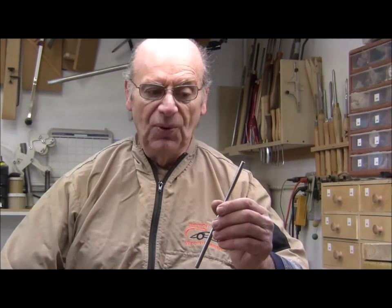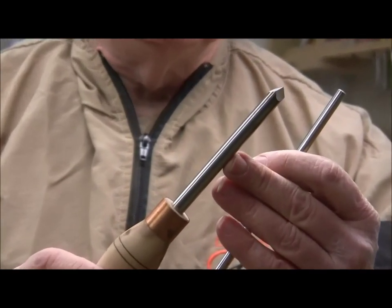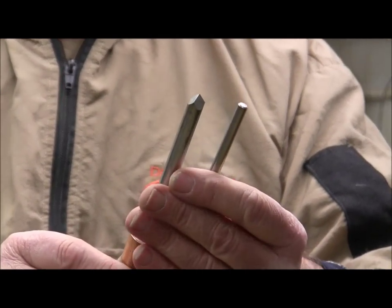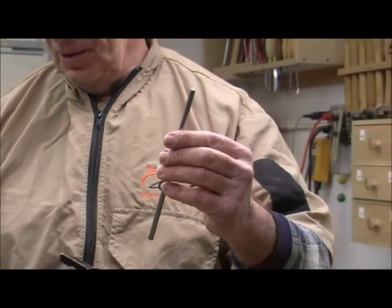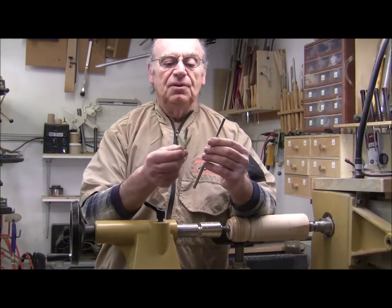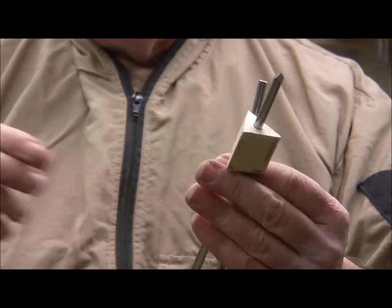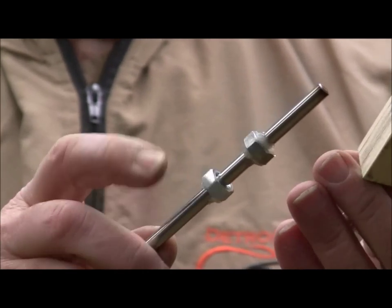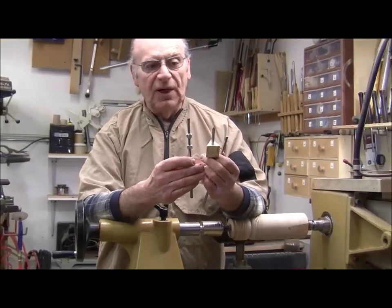This material is a quarter-inch diameter. You can also go with a 3/8 diameter, but my preference is the quarter inch — I like it better than the 3/8. You can get more close and deeper without making a wide groove. So without further ado, let's go to the grinder and show you how to grind this. There is this jig that's got three faces, 120 degrees each, and also another one where you get two nuts and just hot-glue them to the rod. As long as the faces of the hex are on the same plane you're okay — you just put this on the platform and rotate it.